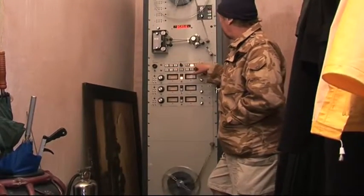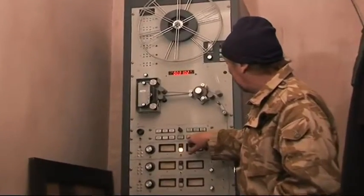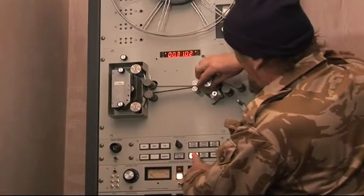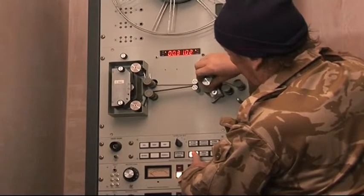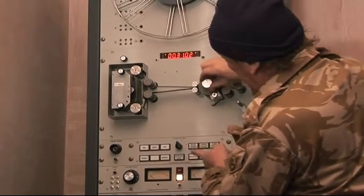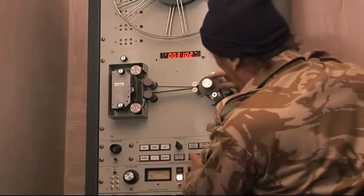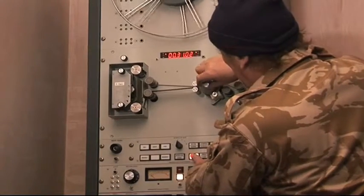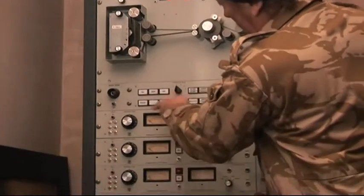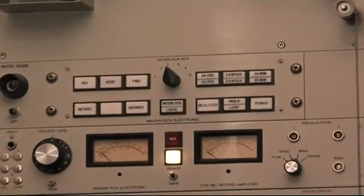Reset to 16mm single speed, and I'll hit D-clutch, and that will allow you to position the tape how you want it. If I then take my finger off D-clutch, it's now locked absolutely solid, and it's actually a very powerful servo. D-clutch, I can cue it and off. And I've got a reels loop control here and interlock and all the other things that you'd expect, advance and retard. Okay, so that's the machine rolling.